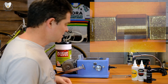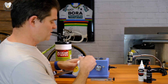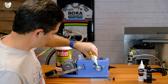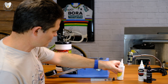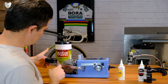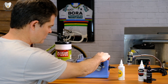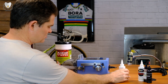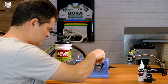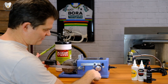Michelle will put it up for you right there. Now let's go ahead and condition our wheel. We'll get our ProGold — shake it up. We'll get a nice little coating of the ProGold lubricant on there. It's quite a low viscosity lube. We'll put a little bit on there as well. You can see we are running at two plates, which is 600 newtons. I'm going to load this up with extra lube. Nice and coated — you can see we're getting a little bit of fling down there.